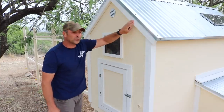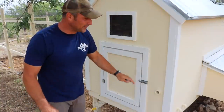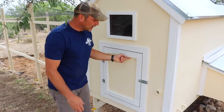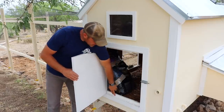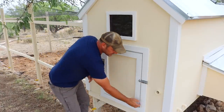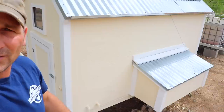With the exception of the gable ends where I used two by fours — I did that because I thought it gave a nicer look with a little more depth. The trim does more than give a nice aesthetic look; it also serves to protect the edges of the plywood as well as providing a weatherproof seal around the doors and windows. On the inside I've used trim to create a little lip so that when the door is closed, any rainwater that gets past there runs down to that lip and then out.